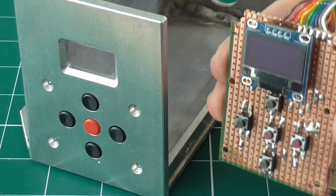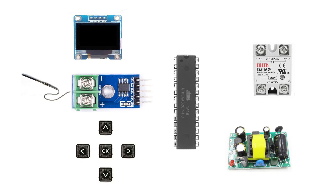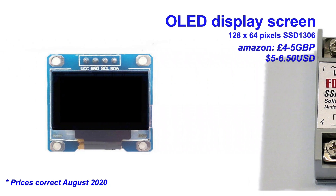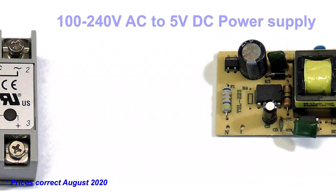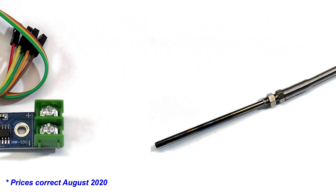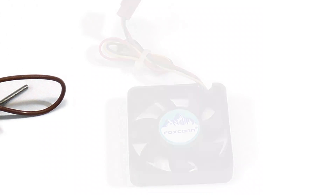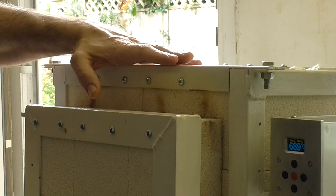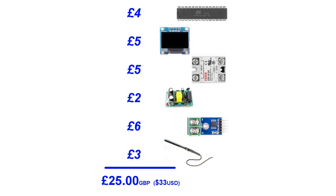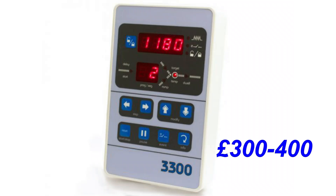These buttons will press against small tactile switches on the circuit board. The components used to build the controller itself include: an ATmega microcontroller, an OLED display, a solid state relay, a 5-volt DC power supply module, a MAX6675 thermocouple amplifier, a high temperature thermocouple, and various screws, wire, buttons, and other hardware. I also fitted a small cooling fan in the box, as the outside of the kiln gets very hot to the touch — the fan keeps the box at a lower temperature. Altogether I spent around £25 on components, around twice the cost of a cheap PID controller, but a fraction of the cost of a similar-featured programmable controller.